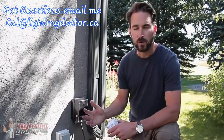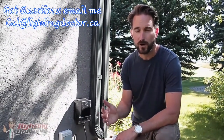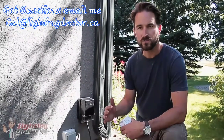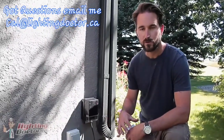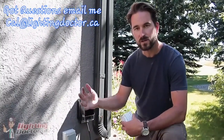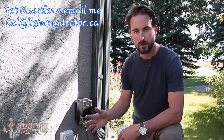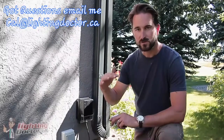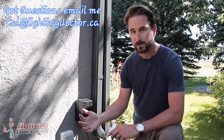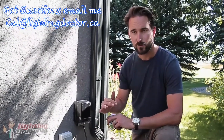On this project we've got 10 lights. Each of these lights uses approximately 4.5 watts, so 10 times 4.5 is 45 watts. So we want to size our transformer just slightly bigger than that. The better quality light that you have, the less you have to oversize your transformer. If you're using a really cheap or low quality light, you probably want to give yourself a little bit more room because the light is going to actually use more power than it might say. With a good quality fixture, you're pretty safe if you just oversize it a little bit.